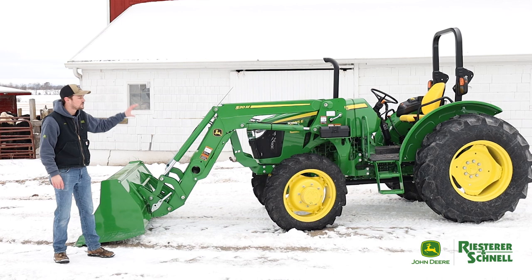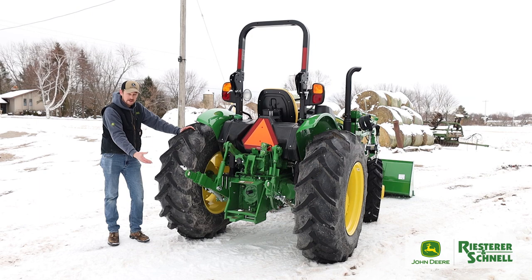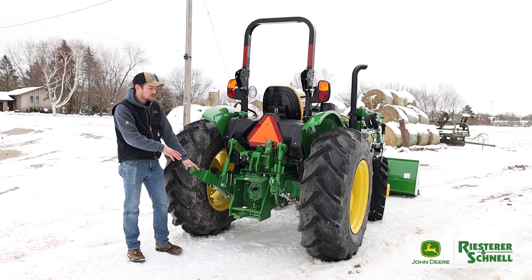Most commonly being the AP12F pallet forks. Tire options on these tractors — we've got three different options. We've got the most popular R1 AG tire with the big steep lugs in it, a turf tire option for our landscapers and grounds maintenance crews, and an R4 industrial tire, more commonly seen on our compact utility tractors. It's that nice crossover between the big-lugged AG tire and the turf tire.